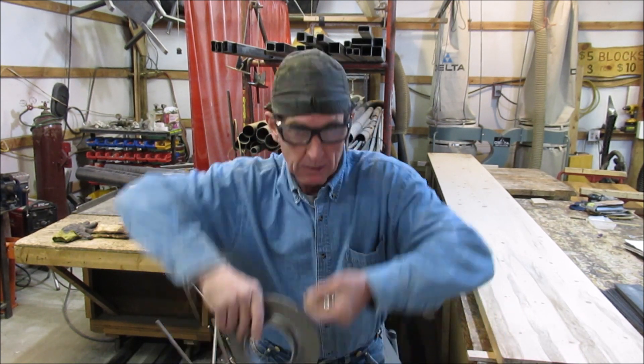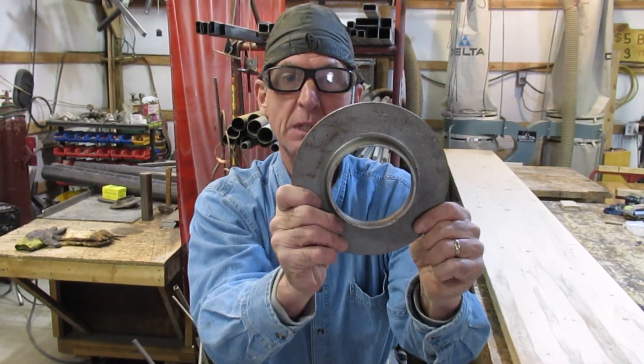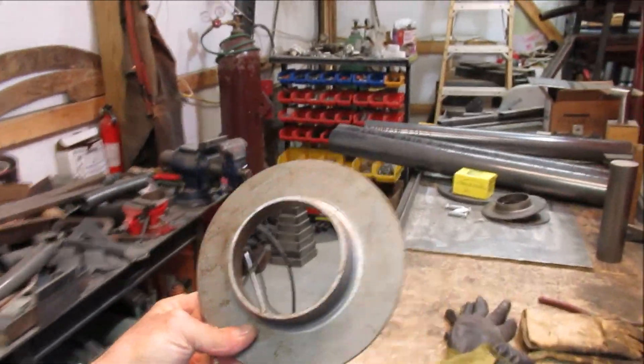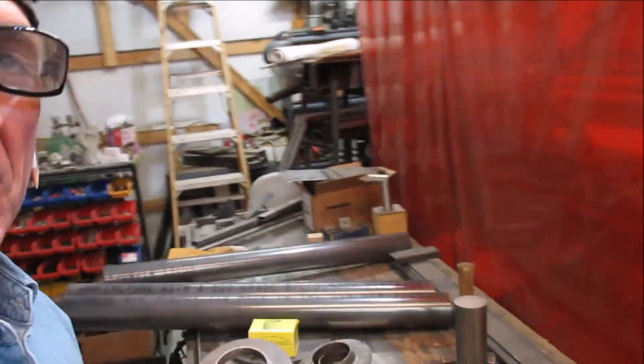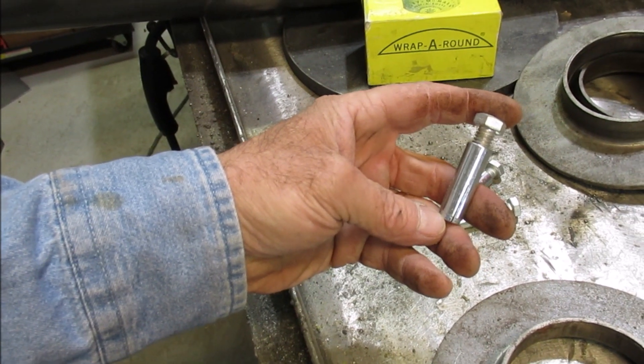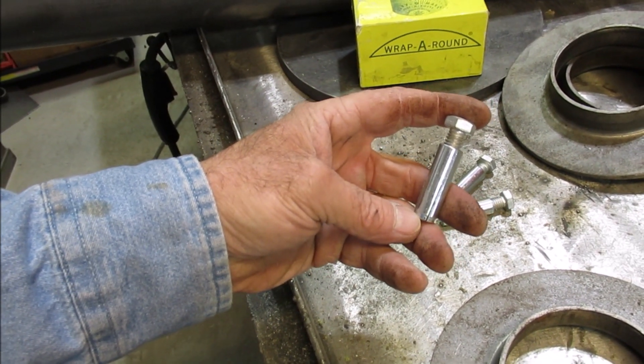It's going to be 42 inches high. We're going to make the bases out of that three and a half inch pipe using these flanges you can get from kingmetals.com. Once we get these things welded together, we're going to be mounting them on a concrete floor, fastening them in place using these 3/8 inch drop-in anchors. So the first thing we need to do is get set up and drill the holes in the flanges.